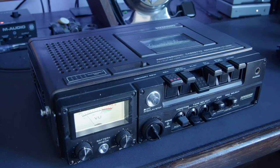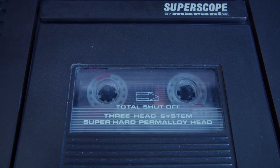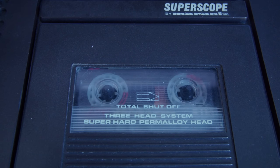The battery capacity, it's definitely going to be less than what it was. 4 D cell batteries, that's a lot of capacity. And just those two lithium cells, it's probably not going to be great. And especially with the three DC to DC converters in there, you're getting some efficiency losses. But it should be, I don't know, it should be fine enough. We'll see if I'll get through this recording. And even if it's not, it's got the USB-C on the back that I can just plug in.